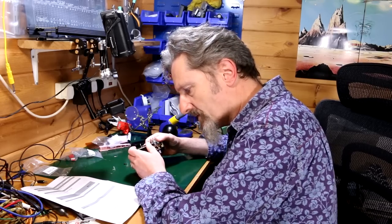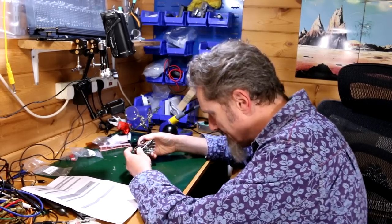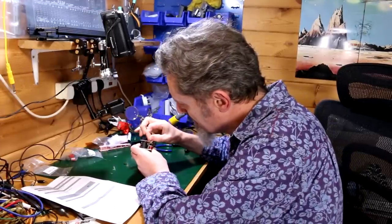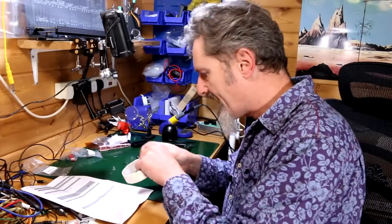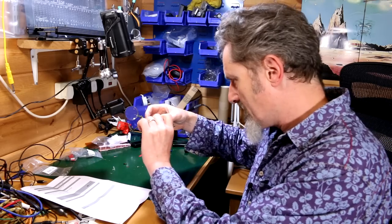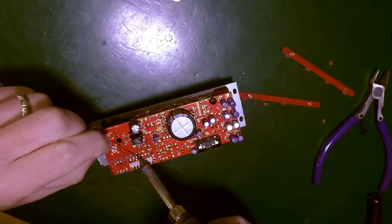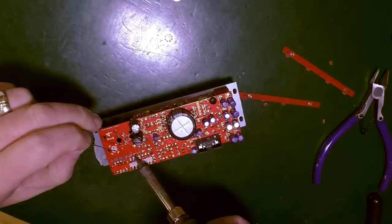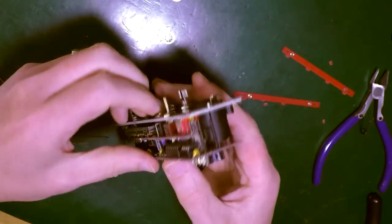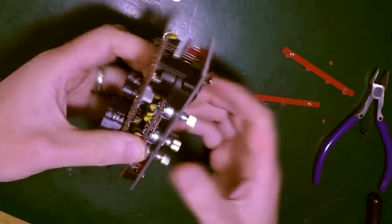So, Neutrik cable through, now fit the LEDs and solder them. Ooh, I've got a whole lot of space. Now, am I going to have these sticking through like I did on the pulses, or am I going to flatten them? Okay, then we're going to go for flat, and that way I can use the magic masking tape. So, put that all the way along there. Last bit. Now, just in case I have to reposition those, I'm just going to leave the legs spiky for the moment.